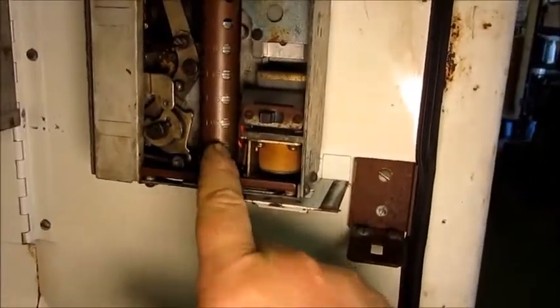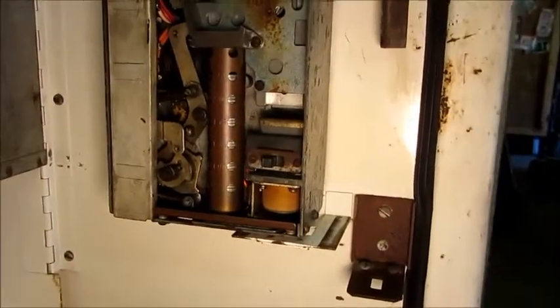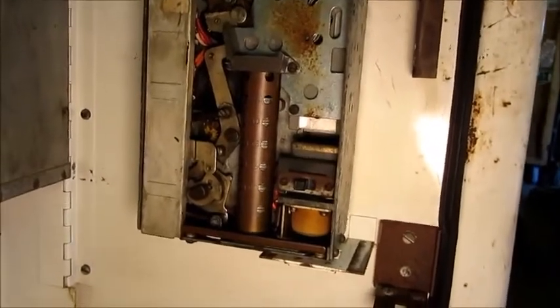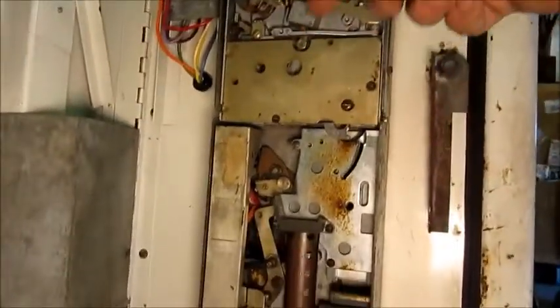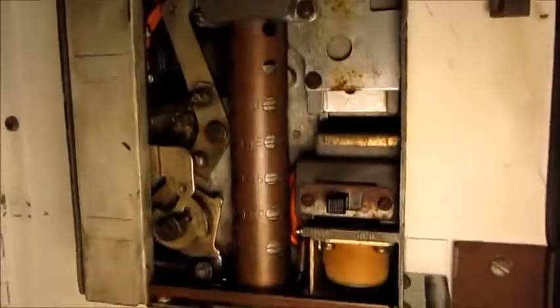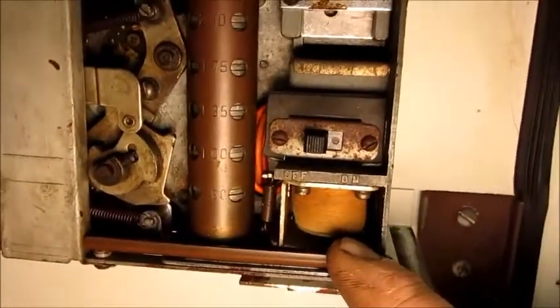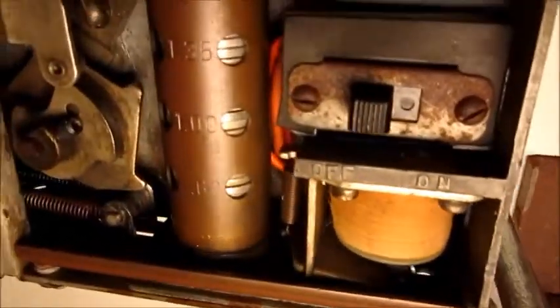With this change-making system, there's actually a limit switch in the back of the nickel container. If there are no nickels in there, it won't let you put in a quarter — it locks that function out. There's a solenoid behind this part that blocks the path of the quarters, and they'll always fall through the reject chute if it's out of nickels. When it makes change, this mechanism slides left and right and ejects the nickels. The solenoid releases the mechanism to slide only three times. I'm going to put a quarter in so you can watch how that works.